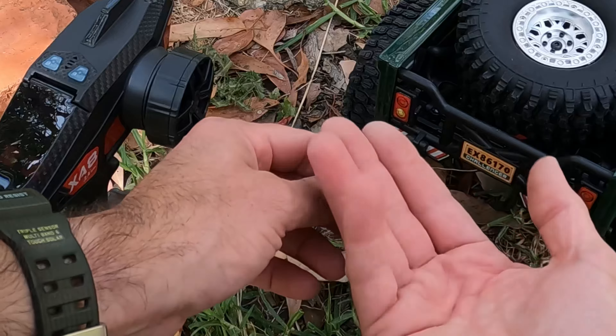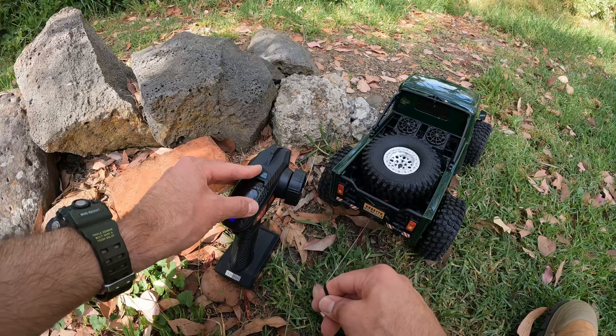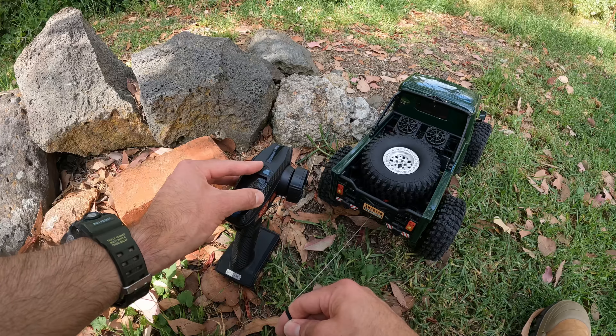Why they didn't do it on a three-position switch, I suppose, is because they had a dig to worry about. When I first pulled this out, this thing came off in my hand. The cable goes through the hook and then comes up and crimps — it wasn't crimped properly, so the wire was frayed and it all came out. I've tied a bowline with the cable using pliers with magnifiers so I could see what I was doing. I finished it off with fabric tape because I don't have any crimp rings available right now. This means I'm not going to hurt myself on the cable, and it's quite functional.